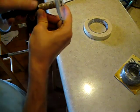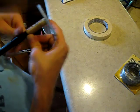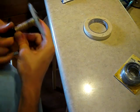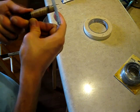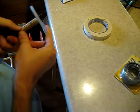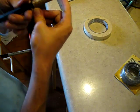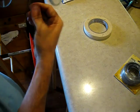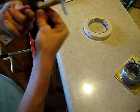We're almost to the halfway point here. One thing that's terribly important throughout the winding process is that you keep tightening up these winds so you don't get any separation or big loose areas. You want to keep these wires as close to each other as possible and maintain a lot of tension on both wires as you go along. You really can't let go of these wires at any point — if you do, they'll unravel and you'll have to start winding again. As I come down toward the end and need to put down the first layer of cotton, I'll show you the technique I use to keep the wires from unraveling.